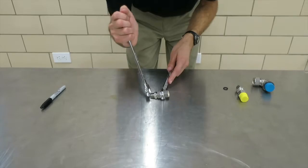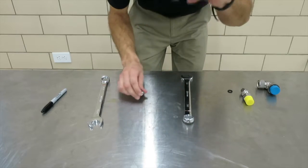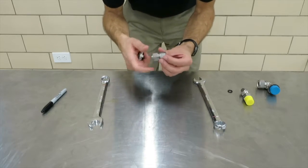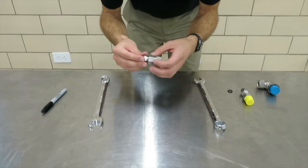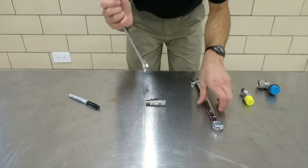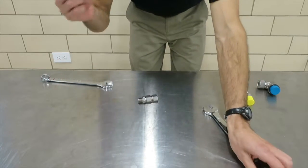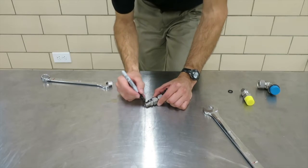So if I undo this real quick — now that nut is pre-swaged. Those ferrules compress a little bit and it locks the nut in place. From then on, whenever you're tightening this fitting — whenever you get a valve that's been pre-swaged — it's just a quarter turn. Now that those ferrules have been compressed, next time I install this, all I have to do is put my mark and just tighten a quarter turn. When you're done, it's always good to communicate to everybody else that this has been tightened. You can put a torque mark to show that it has been tightened.